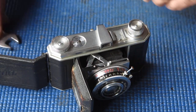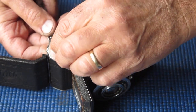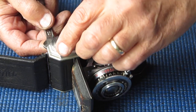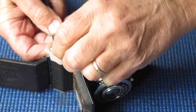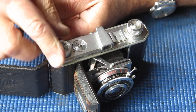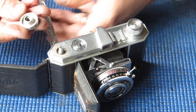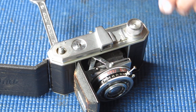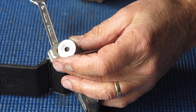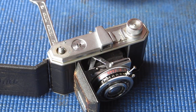I do need to have the advance knob off however. I'll put the spanner on the shaft to stop it from rotating. The advance knob came off without hardly any struggle — that's good. Most commonly I have to wrap this in leather and put a hose clamp around it, done up very tight, to get enough purchase to unscrew it. It's left-hand threaded of course.